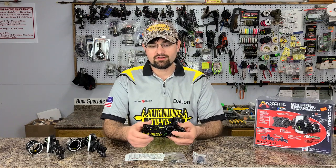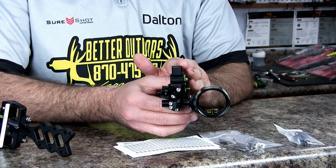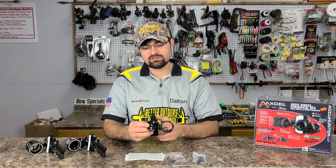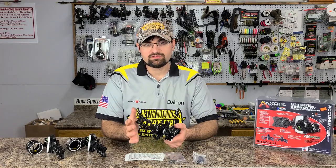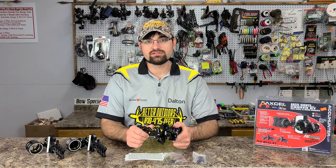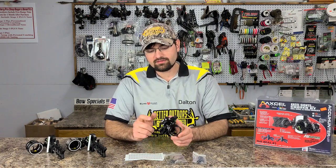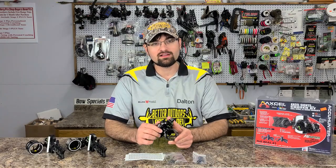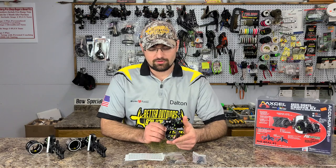Your second axis is set with these two bolts to level the scope itself. Then you set your third axis — also two bolts — which handles uphill and downhill angles; it's a door-swing style adjustment. A change they made that I really like is going to two bolts for the third axis adjustment, making it much less likely to get loose or move. It pretty much bulletproofs everything.